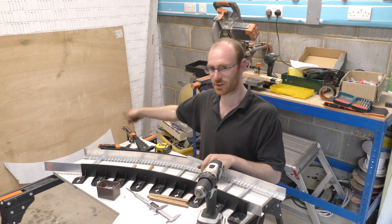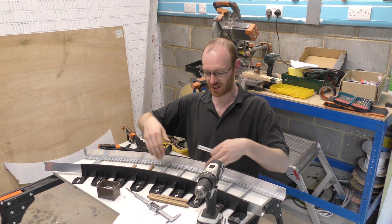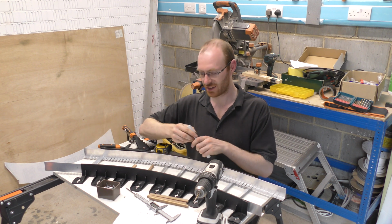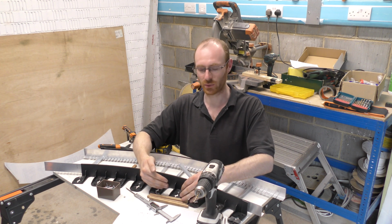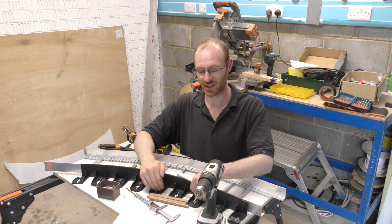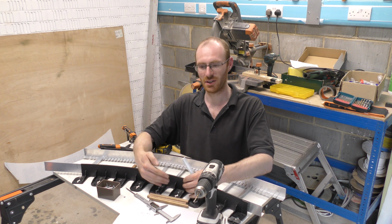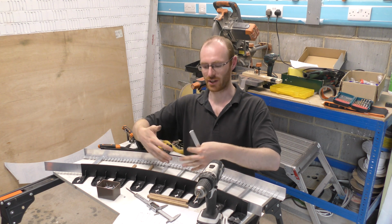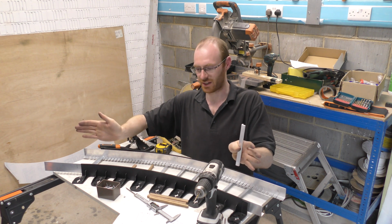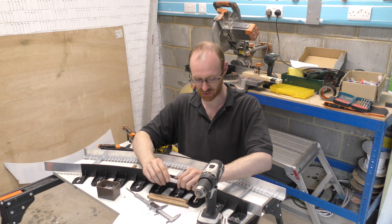And I did that by first putting the acrylic that's sat down here in, putting the aluminium sides in, clamping it, screwing it, easing off the screws this side on the inside, just to allow a bit more wiggle room because the acrylic doesn't need to be tight. I loosened the screws on the inside because I don't mind if the radius is slightly too sharp on the inside, because it'll always want to ease, it'll always want to push out. So it's better to build the bridge slightly tighter radius than you need, because it'll always ease back as the metal wants to go back in position.